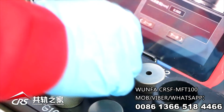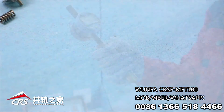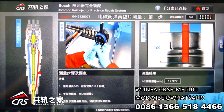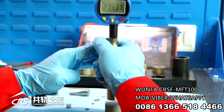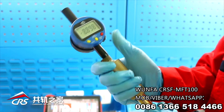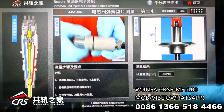Measurement of magnet spring shim. Choose G05, set 0 on G11. One hand holds the magnet while the other hand measures the dimension — press the data connecting button to take the value. Next step: choose G06, set 0 on G11. Pre-assemble the armature group and handheld the kits. Measure the dimensions and press the data connecting button to take the value.